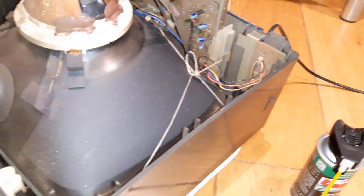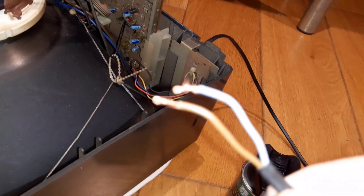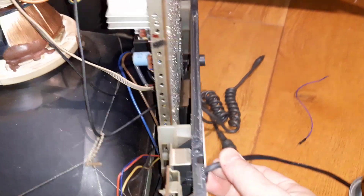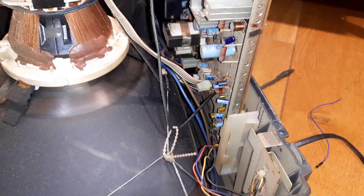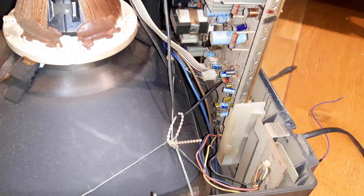This came with the power cable cut, as you can see here. I removed the shield of the cable just to connect it to the outlet to see whether or not it could work, and I saw that it powered on - so that's a good thing. What I'm going to do is remove this built-in power cord. Those old TVs and monitors had this thing with the power cord built into the whole frame, so I'm going to cut the cable and add one of those outlet connectors on the case itself. I have done this for other equipment and it worked beautifully.